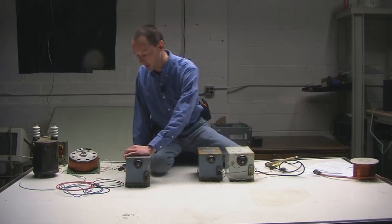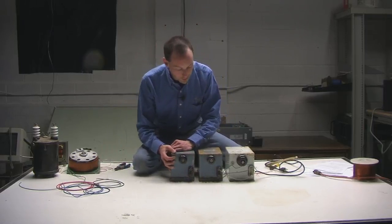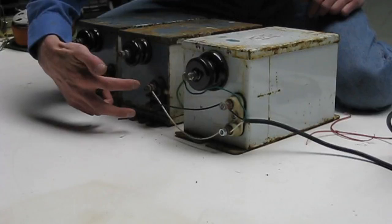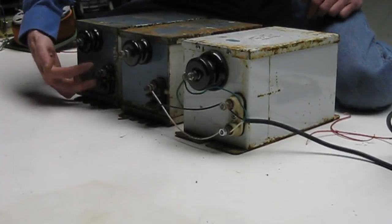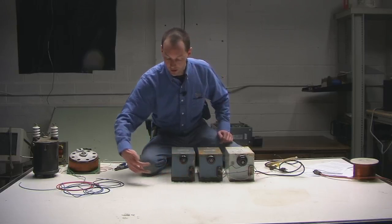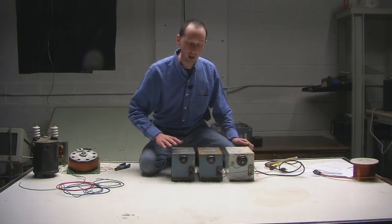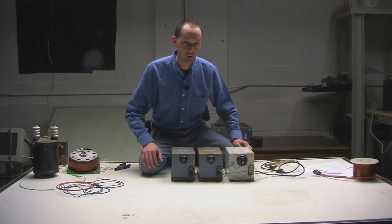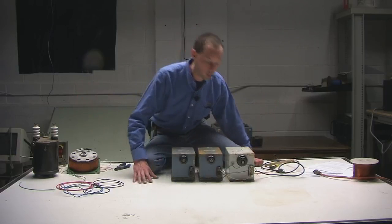So you grab your next NST, you slide it over, and these are both the exact same transformers, so it'd be pretty obvious that it'd be straight across. And you phase this one and get it where you want it, and then you do the next and the next. And the only limit to how many of these you can hook together is how many amps your wall power supply can feed. I mean, you could have 1,000 of these in a row.